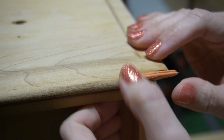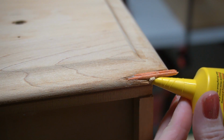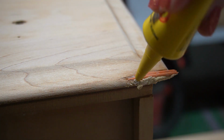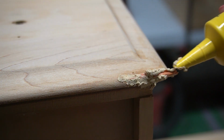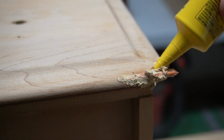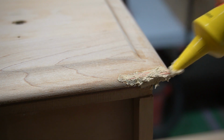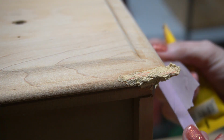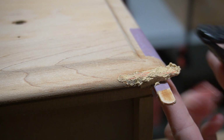On the other damaged corner, I didn't need as much structure, so instead I glued toothpicks directly to the surface. And PVA glue is pretty strong, so I trust this to last. Then I used a stainable wood filler to shape the rest of this corner. I rounded it out well above the surface and out past the edges. That way I'd have something for sanding. This tape-coated popsicle stick kept the fill from slumping as it dried.